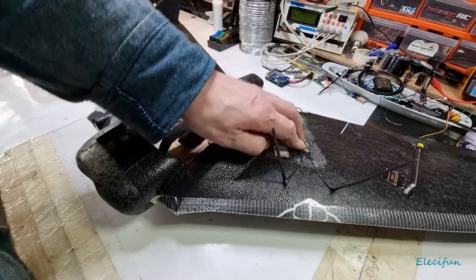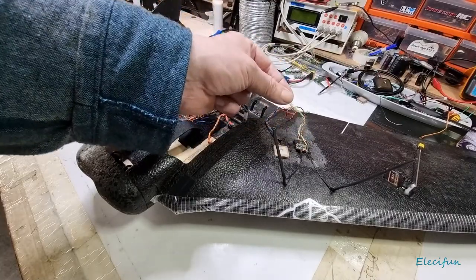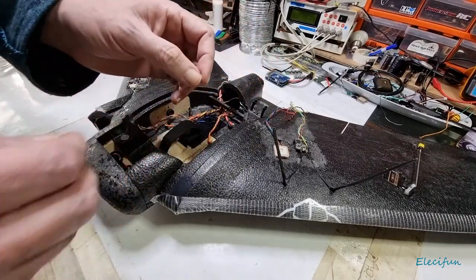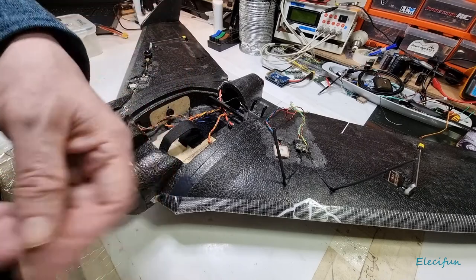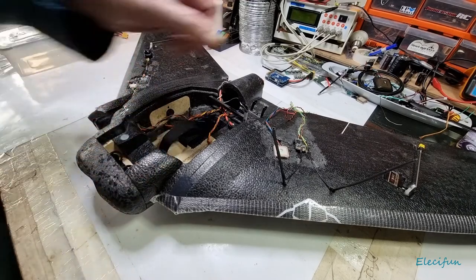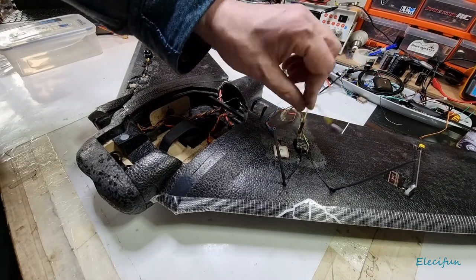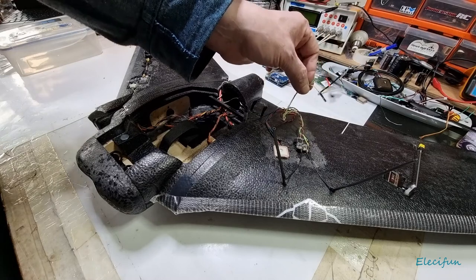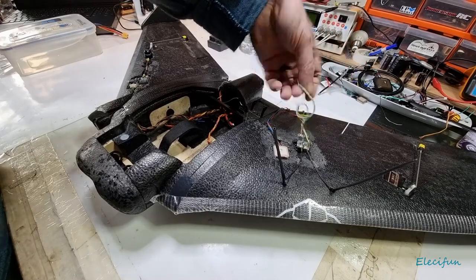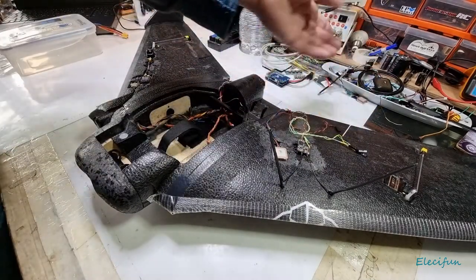And that's what I like about these as well. The reason why I bought this in the first place, not this particular one, but TBS, is because of the way it connected. It was easier for me to understand that than getting my head around a TX on another S-port on another pad, and then somewhere else on the board finding the jumper for it. No, this just sorted that out straight away. It either works one way around or it works the other way around. But just remember, transmit goes onto receive and receive goes onto transmit. And that's it on your power. Of course, it uses very little power, so that's good. That's the sort of thing you can just unplug from the board, pop onto another one, and you're off again.